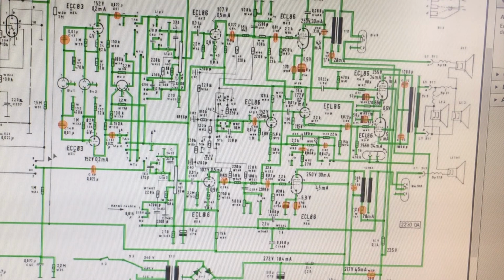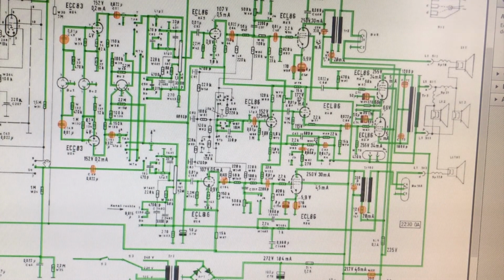We've got the signal coming in. I've actually done some sine wave inputs, 1 kilohertz sine wave inputs in here, and seen them or heard them coming out, and tried the stereo. It works. It's a bit boring to sit and listen to 1 kilohertz tones. That's why I decided to try that music. The point is that stage is done.